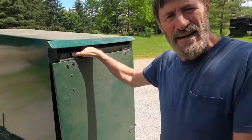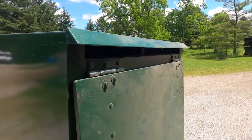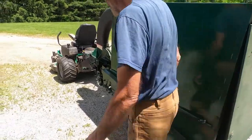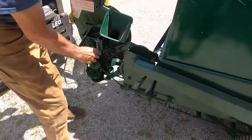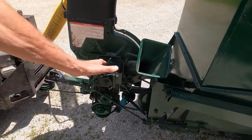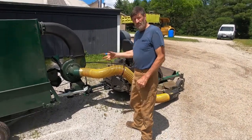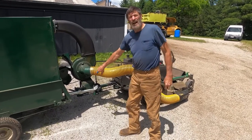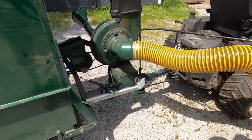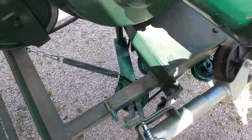This up here is an air chamber — there's a screen in there to keep the grass from flying out. You have to have an exhaust on the blower and the air has to go through it to contain the grass, otherwise it won't work. It's always exhausting the air out here. It's a good clutching system — you can properly hook up the belt, the idler lifts and guides the belt, and then you turn it off. What I'm going to do here is start this up real quick and show you just how much that idler has to move when I steer. You'll see it's not really that much — probably a couple of inches at the most. You'll see the gap between this idler and this arm get longer when I turn.